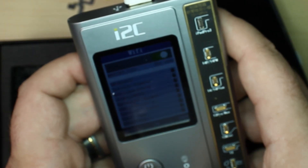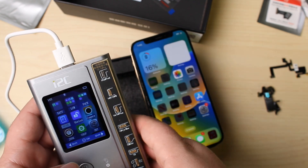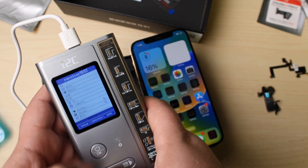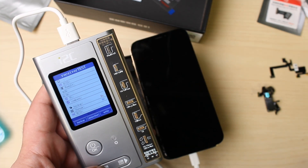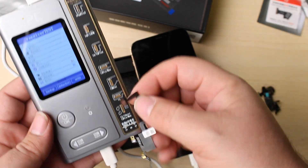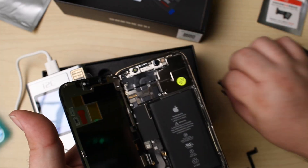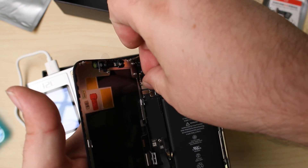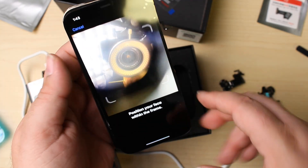It's really simple. This just needs to connect to Wi-Fi. You plug in the phone, trust the phone to the device, have the original proximity sensor connected in the device, then it's as simple as going through a series of clicks on the programmer to read and back up the data, then connecting the new flex, writing the data to that, and plugging it into the phone, and you're done. Of course, solder an ear speaker on to finalize the repair, but it's that simple — you can get the proximity sensor replaced without losing Face ID.